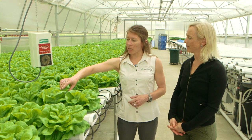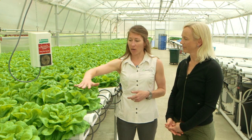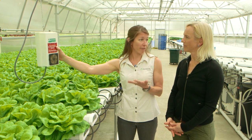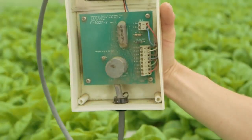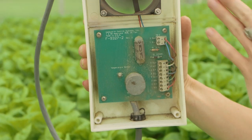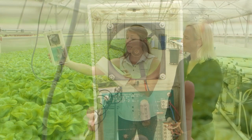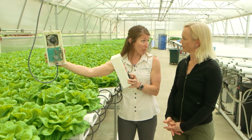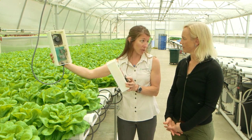The plants actually go through photosynthesis and transpiration, and they do that by air coming across the crop. We're going to try to emulate that using an aspiration device. Inside here are the temperature and humidity sensors. It's pulling air through the filter in the front and out the back using a very simple fan. We're trying to get as close as we can to the crop and make sure the environmental controller makes its decisions on heating and cooling using that temperature and humidity sensor.